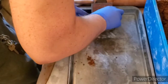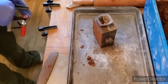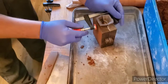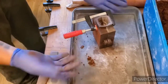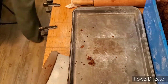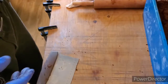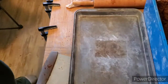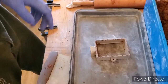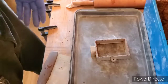We should only need the one vent, just to help the gases and the air flow. Make sure it's nice and smooth — we don't want any loose sand to get into our mold. Add that together, add our C clamp — so there we have it, that's part one. Because that was such a short cast, we are going to do a second one: the tail of the velociraptor.